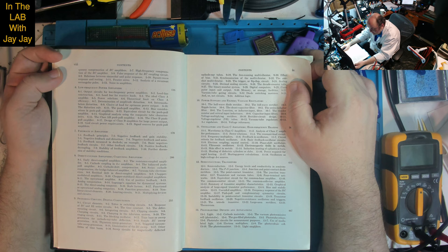The differentiating circuit. Integrating circuits. Clipping circuits. Clamping circuits. Clamping in the television system. The ringing circuit. The blocking oscillator. The time base or sweep generation for cathode ray tube deflection. Simple RC sweep generation. Thyratron sweep generator.